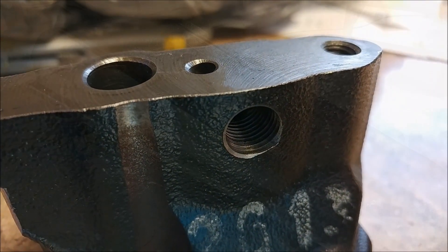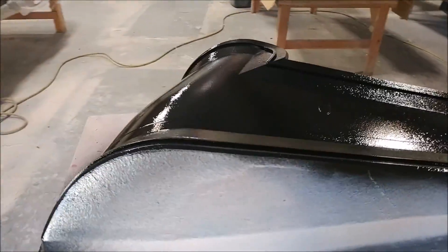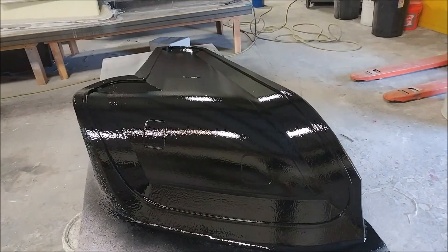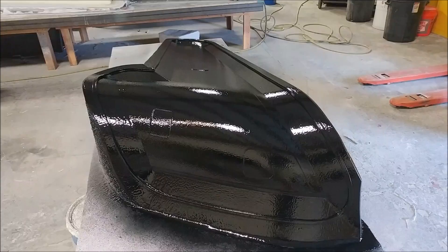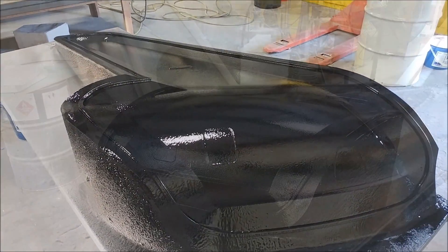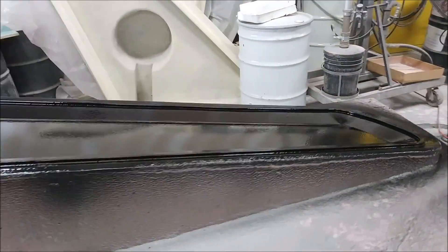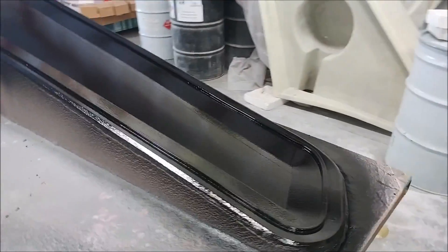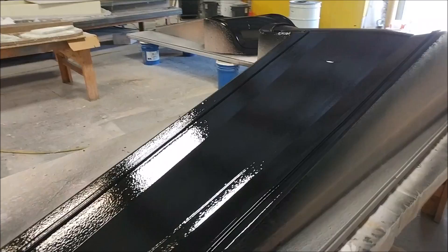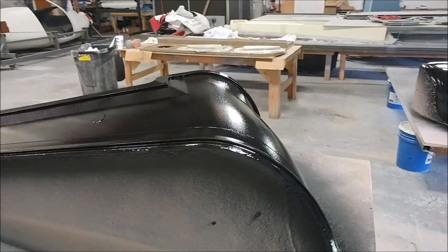Off to both turbos, as you'll see later on. While I was away, the guys got these winglet plugs ready for a pull mold. This is Monday again and the top coat has been sprayed on in preparation for laying up that particular mold. Here's the other one — both of those are ready to go now. They'll get one layer of glass put on, then some heavier layers, then some core, and finally extra heavy layers with bracing that you'll see shortly.